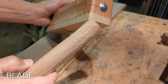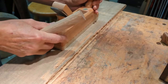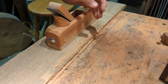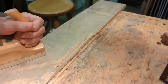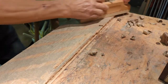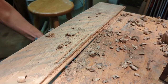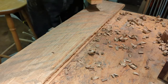You see this little spot at the back here - if you find the blade is out too far, you set it down on your piece of wood. You should use a heavier mallet - they actually make brass ones - and you tap the back to drive it in. And it does remove a lot of material.